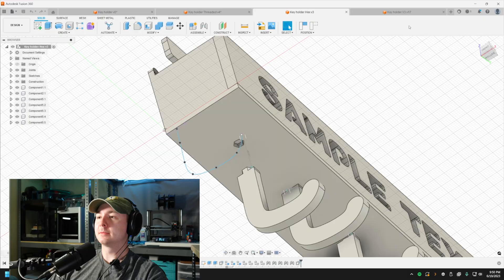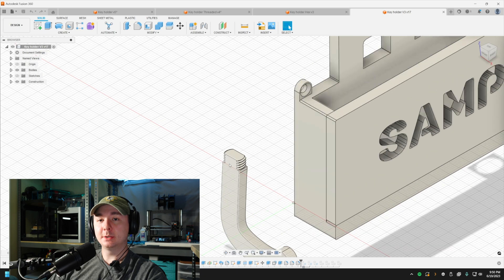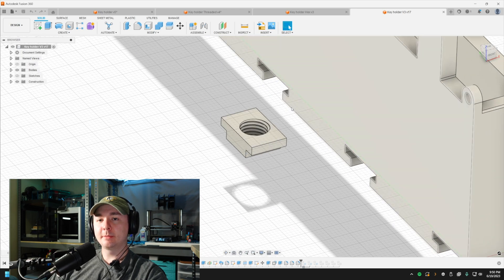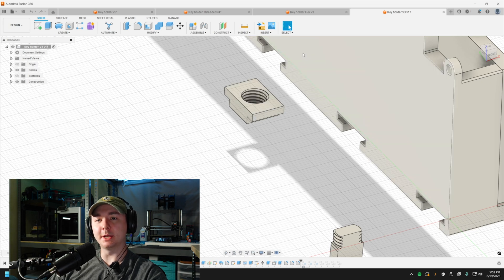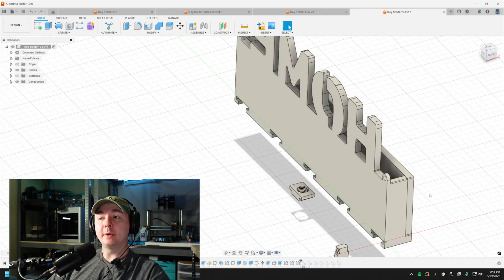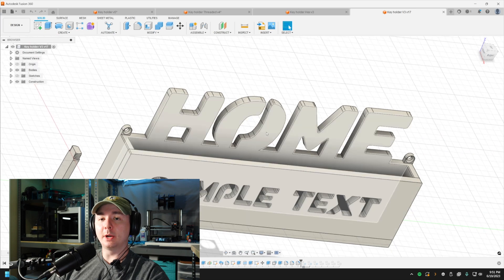So I had to go redesign it again. Then I came up with my last and final idea, which is what I'm going to show off later, where I'm still going to use threads, but I beefed those up a little bit and made them bigger. And then I added a part that you slot in, and the threads in this are longer than the threads in this part. So that way, when you slide it in, they overextend past this and it locks them into place. They're small and they don't have a lot of strength to hold it in place, but that's okay - you're really only putting your keys on here. And if one were to break or slide out, you'd be able to just replace it.